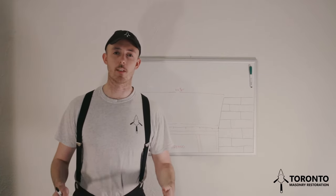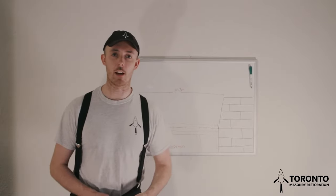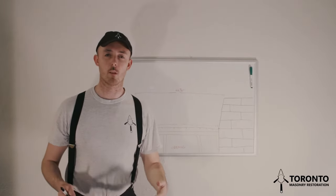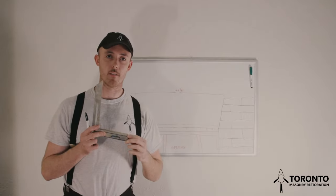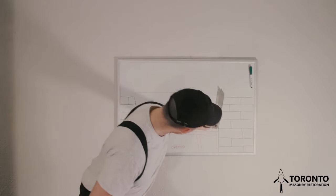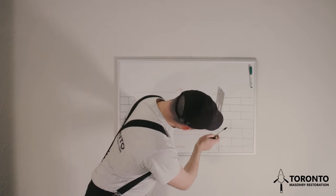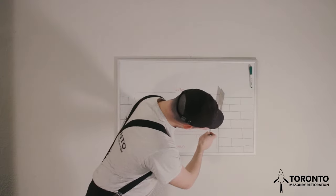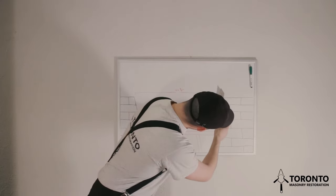As I mentioned, we'll start off with a stretcher at each end of the arch. The first thing we will do is get the angle of our skewback. So we'll take our T-bevel and put it on our form, and we will get this angle here. The bottom of our T-bevel will be sitting flush with the form,